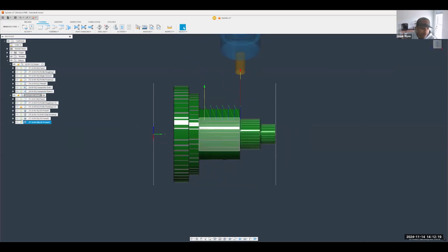right here. So maybe, can I draw? Yeah, we could draw. So think about the chuck being somewhere there, or holding out of the part somewhere there. So now your tool can come in, if it has enough clearance, and cut that pocket right there. So you would cut the flats before we did the threads, right?